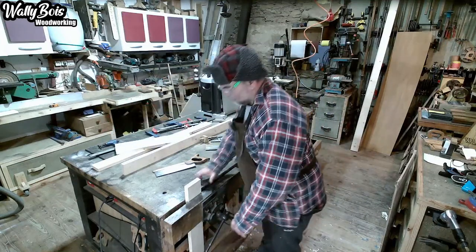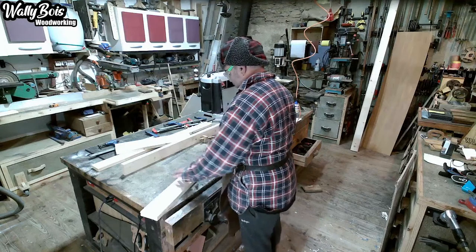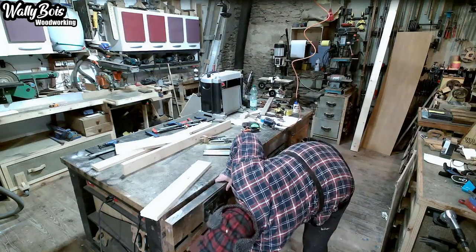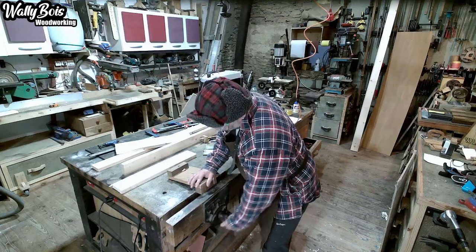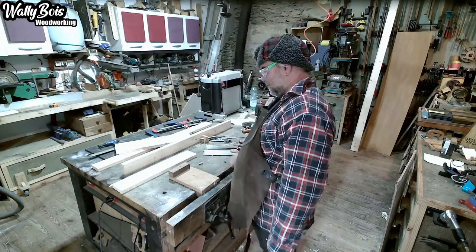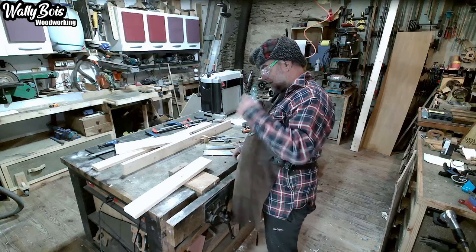So next, what we've got to do is cut the shoulders. These are the shoulders, which I'll show you now. But how we're going to do that, it's a bit awkward because I've got to do it at an angle. I'm going to use a bench hook. Anyone who went to school and did woodwork has probably seen these before. This is a bench hook. Just one way of doing it. And it gives you something to hold your piece of timber. Makes it a little bit easier.